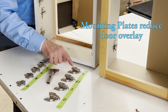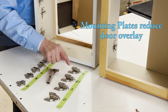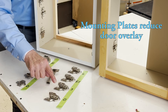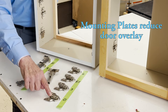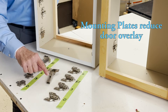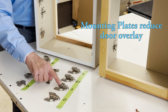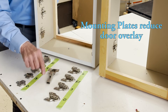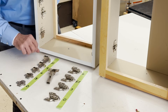Over here is the face frame series of mounting plates. I use them interchangeably — I will use these plates on frameless cabinets, but they were designed for face frame cabinets. This is a zero mounting plate; you can use it interchangeably with the frameless zero mounting plate — it has the same effect with the hinge. The three millimeter plate will reduce your overlay by three, then 4.5, and six, and so on. So that covers the face frame series and the frameless cabinet series of mounting plates.